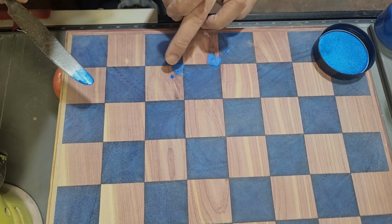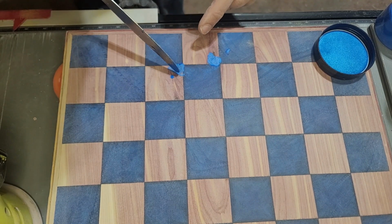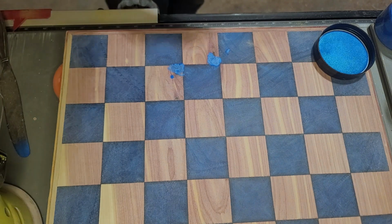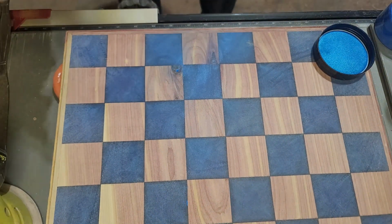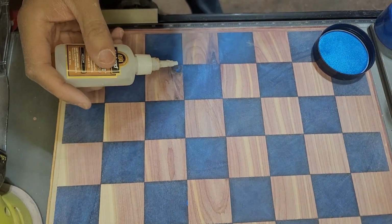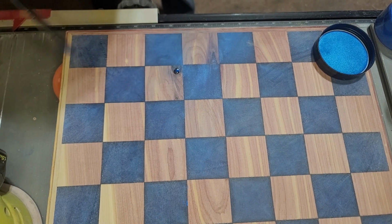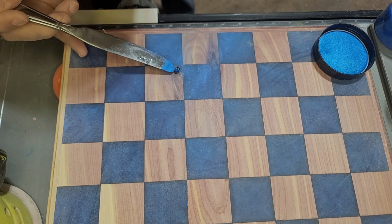Here's a 323 pro tip for you. Occasionally you'll have projects where you notice small holes and gaps in the knots or in the wood itself. Don't waste your time trying to fill those right away. At least wait until you get the board to final size, because there's a good chance that you end up sanding away all the work you did only to have to do it again.